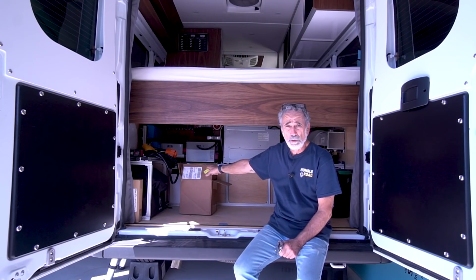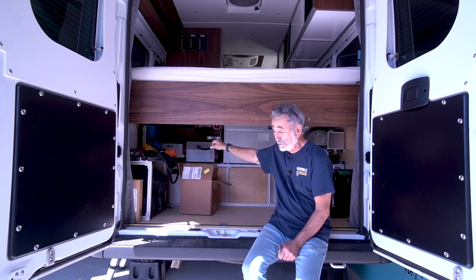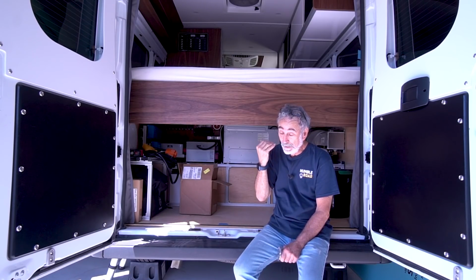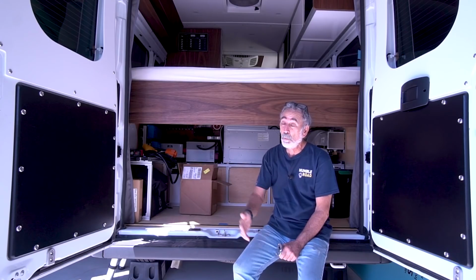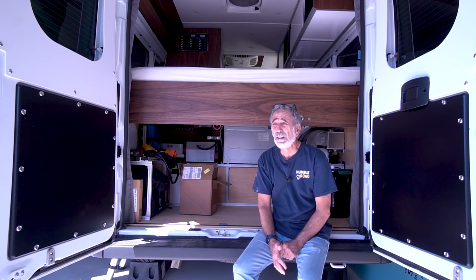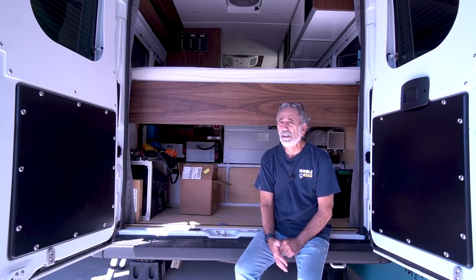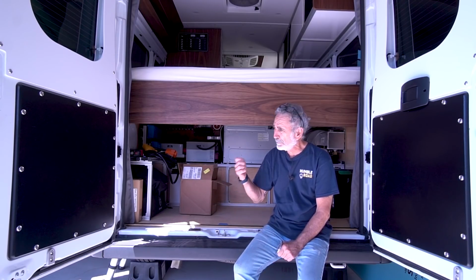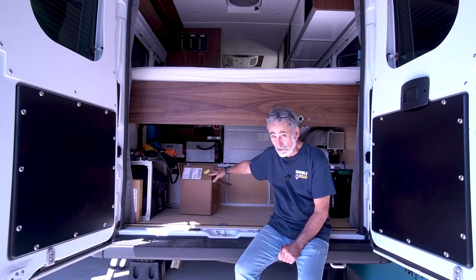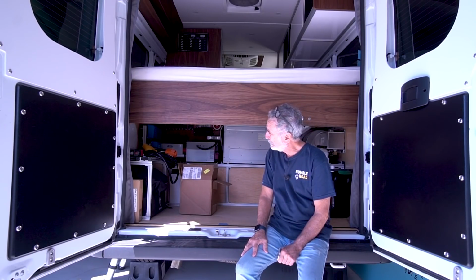And I left room to run my 4-aught cable from that new alternator all the way back to my bus bars. Now, I didn't want to run the 4-aught cable in anticipation of him wanting the second alternator in the future, because it's very expensive. But it turns out he wants it, and I ordered it, and I'm putting it in. I've got the holes drilled. I just have to route the wires. I've got Gus coming on Saturday to install this alternator, and we're off to the races.